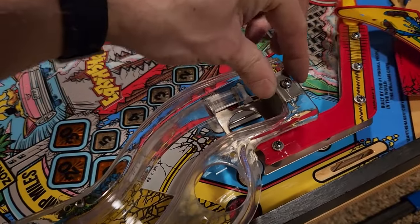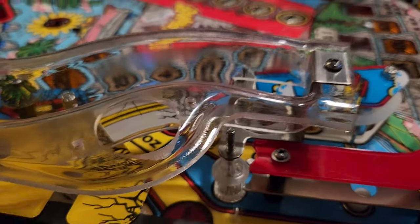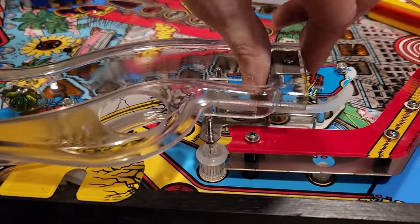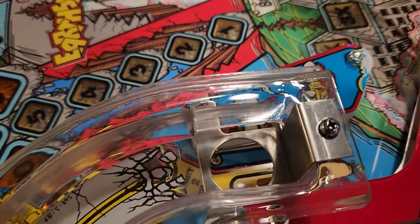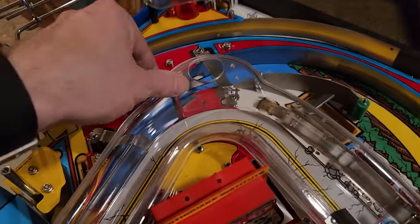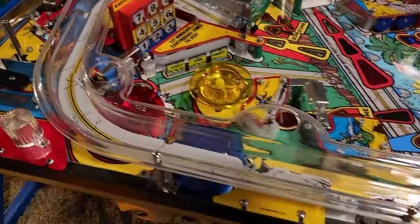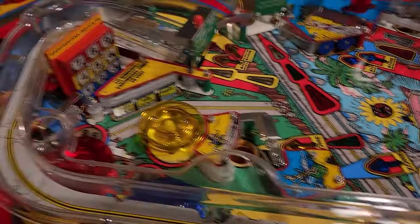What I had to do to get this working — because it's not just a protector, it has to be aligned with all of this — was basically use a torch and heat up this end of the ramp, then push it in so it sits right snug. It looks pretty damn good. I've got the ramp essentially mounted, I just need to screw it to the playfield. Wanted to make sure there weren't any other issues, but now the ramp should be ready to mount.